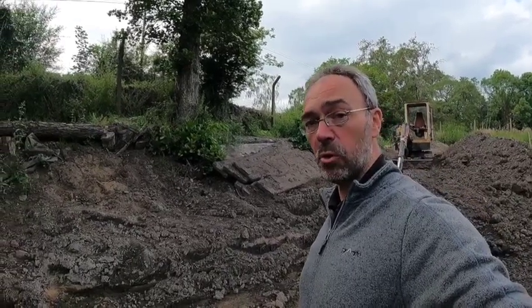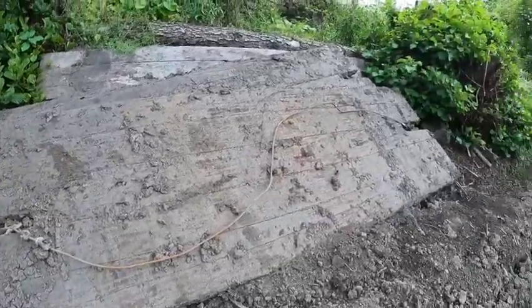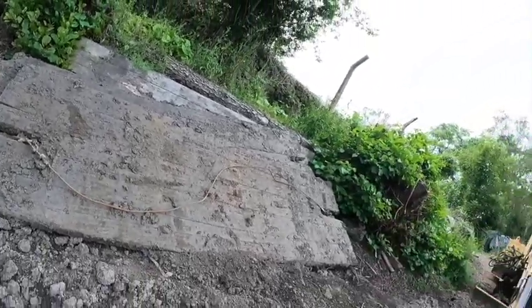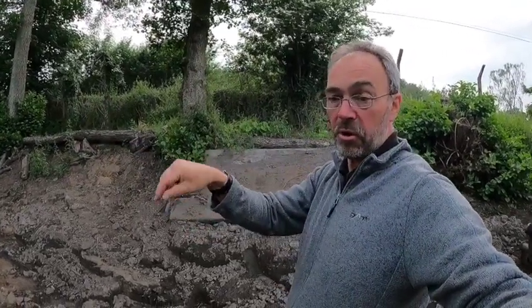But using the bog mats really helps, because you just don't get stuck because you sat on top of the mats. But it is a bit of a chore to move them. What I do at the moment, I have this bit of wire with two hooks on, which attaches to the timber mats, and then all I do with the bucket of the digger is lift them up by the wire, come round, put it back down again, have to get out of the digger, undo the hooks, take the wire off, track onto the mat, then turn around, pick up another mat, which is a lot of getting in and out, which takes quite a long time, and the hooks keep slipping off and various other things. But it's all right, I get there, and it just makes it very slow.